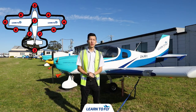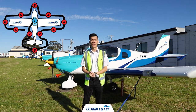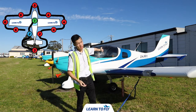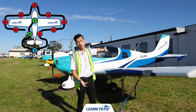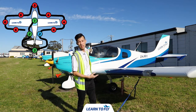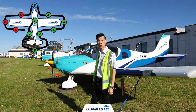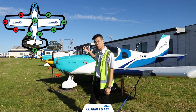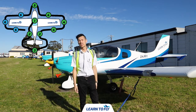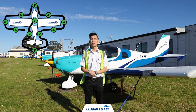In this pre-flight video we're going to check the cabin first — all the switches are off, all the required documentation is on board, and the cabin itself is well organized. After the interior is checked out, we'll move on to the exterior, starting from the left-hand side fuselage, then the tail section, also known as the empennage. We'll work around the tail to the other side of the fuselage, onto the right wing and landing gear assembly. After the right wing, we'll move on to the nose section including the engine and propeller, which is the most important part of the aircraft. After that, we'll move on to the left wing with the pitot tube, the fuel and the lights. After those have been checked, if we're happy with the general condition of the aircraft, we can jump in, start up and enjoy the flight.